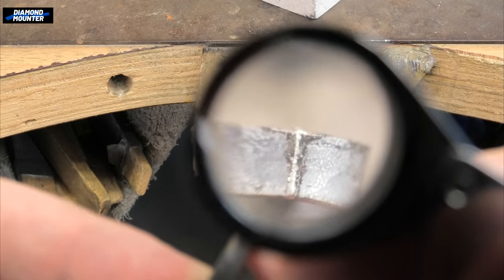Check your join flooded on top, down the outside, and down the inside — always worth a look. You should be able to see the solder gone all the way around. People who've seen my videos will know I always go on about having a tight join, and the benefit is clear: my join was good, so I used just a small bit of solder that flooded easily, first time. That's as strong as possible, as neat as possible, saves time and money. Tight joins are the way to go.